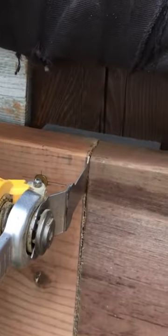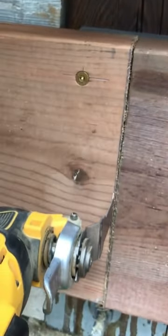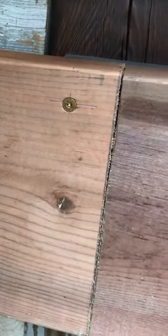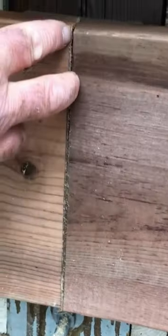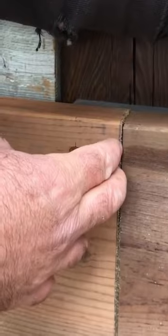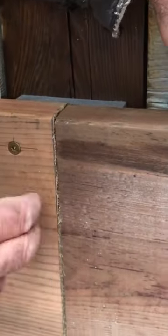I'm going to use this multi-tool. I am going to plunge this in all along the length of this joint. The kerf of the blade will cut more down here where it's currently touching than it will cut up here — it probably won't cut anything up here. I'm going to move the board over a little bit, hold it in place, and then do it again.